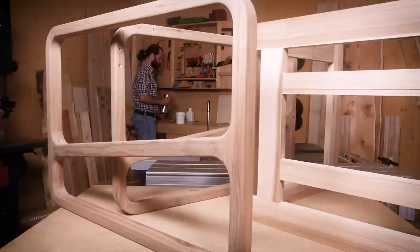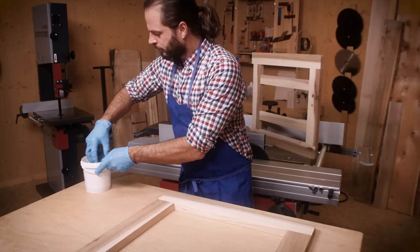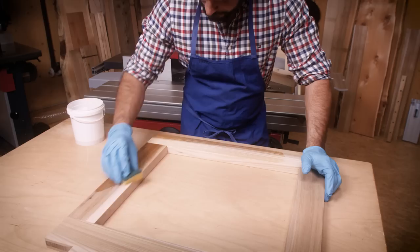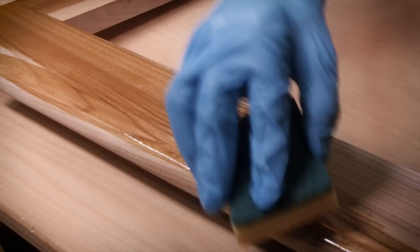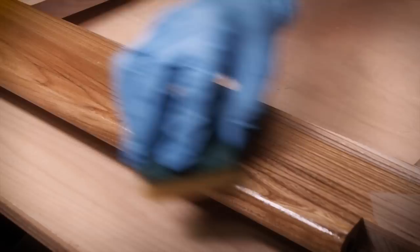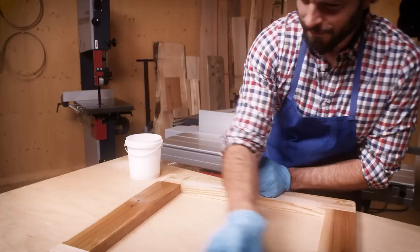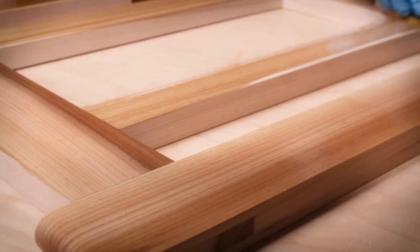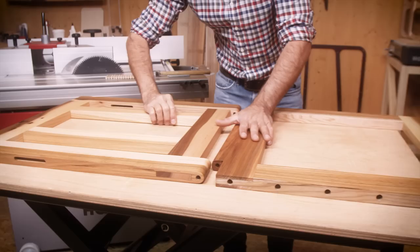The first step towards finishing is to oil the seat and backrest. We use linseed oil varnish because this oil lights up the wood grain beautifully. Attention to not oil the surfaces with the dowel holes. Now everything is ready. Let's start with the final assembly.